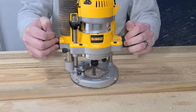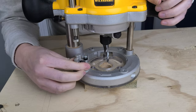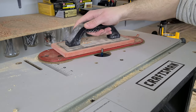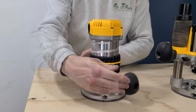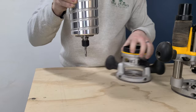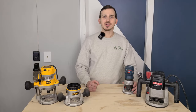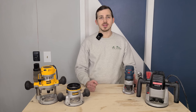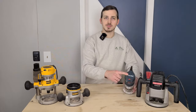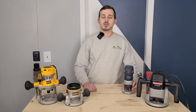If you plan to route out larger pockets or do larger inlays, then get a plunge router — the ease of setting and incrementing the height will save you tons of time. If you usually work with smaller pieces and want to set up a router table, go with a fixed base router. Or better yet, get a router that has both a fixed base and a plunge base. Remember, the larger the bits you intend to use, the larger the horsepower you'll need. Router tables may see these numbers creep up in order to handle larger bits.